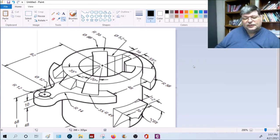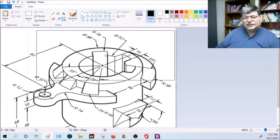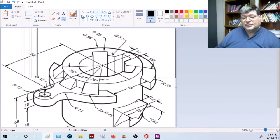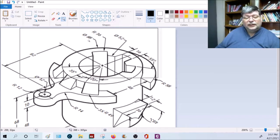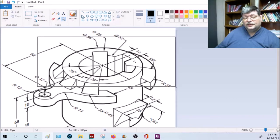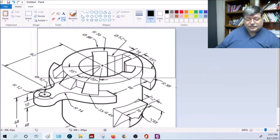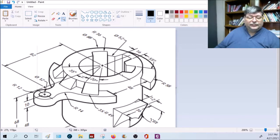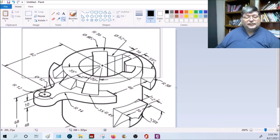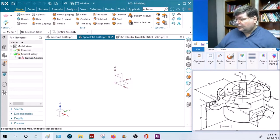Anyway, there's a hole on the inside with three features. They don't dimension every feature, so we can assume they're equally spaced - the sides are 16 millimeters apart. When a dimension points to a line and says radius, we know that line is an arc - it may sometimes look fairly straight but it's an arc. It's 88 millimeters for the whole diameter. If it's 55 degrees from this edge to that edge, it's also 55 degrees from the center of one toe to the center of another. This thing is 68 millimeters tall and 88 diameter.